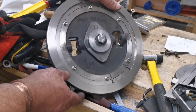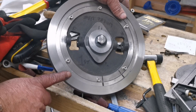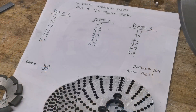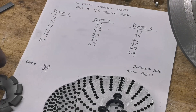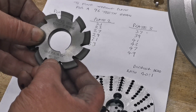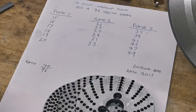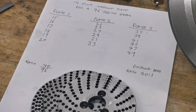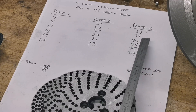That's the main drive ring done, ready for cutting the teeth. Now we've got to do the maths to find out what indexing plate we're going to use for 96 teeth. We need to cut 96 teeth on this drive gear. First thing - get the right cutter. I've got a number two cutter here which does 55 to 134 teeth, so I'm going to use the number two cutter. Then we've got to find out the indexing plate. I've got three plates ranging from 15 to 20, 21 to 33, and 37 to 49.